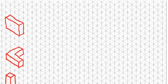So to make a multi-view of this, I'm starting off by saying, okay, this is going to be my front view. It gives the longest dimension, and it gives the most contour. So this right here is my front view. Typically, this would be the right view, and this up here would be the top.